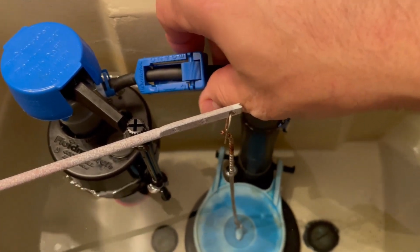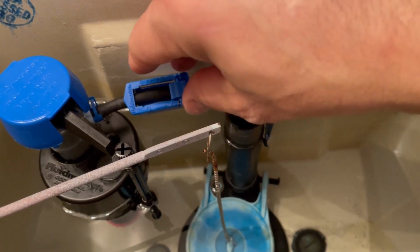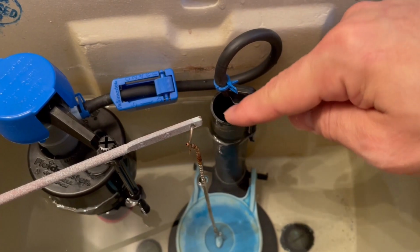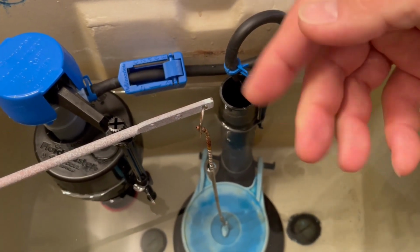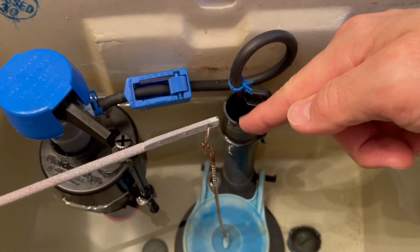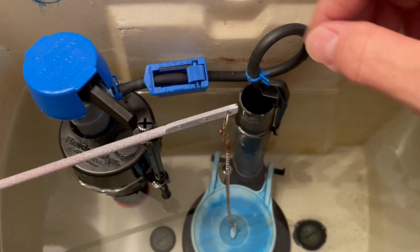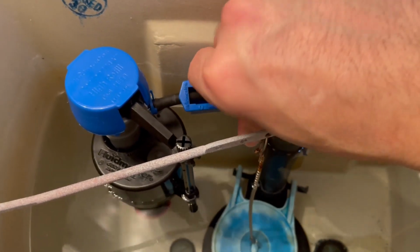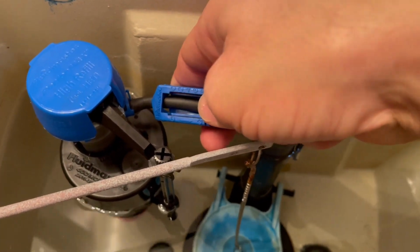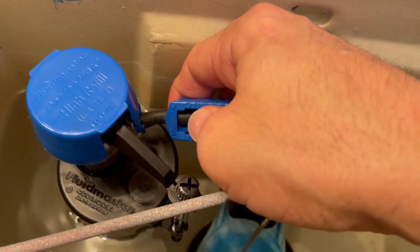I will start off with nothing. Let's tighten that valve completely and push no water into that pipe. By tightening this valve, we're going to stop the water from flowing into this pipe and being wasted pretty much. So let's start by tightening completely with no water going into that black pipe and then flushing. Let's see how much water goes into our toilet bowl after we flush.